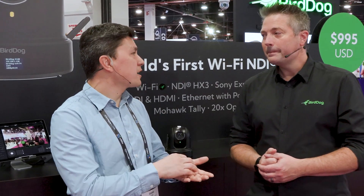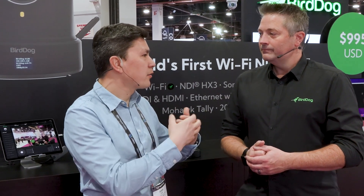A little bit of tech specs — let's talk sensor size, zoom range, and the lens ramping from wide to telephoto. So it's a 20x zoom, which is actually a really quite long zoom — it's amazing how far in that 20x throws. A lot of smaller cameras, particularly this size, will only be 10x in terms of their capabilities. In terms of the clarity of that, it's all glass, so it's a really high quality zoom. In terms of the sensor size, it's a 1/2.5 inch. It's a reasonable size sensor for the type of camera that this is, but if you actually look at the image quality, the behavior in low light is really incredible. That's owing to the types of sensors we use within our cameras — BirdDog is really quite unique. We build our own cameras from the ground up, we specify exactly what sensors we use, we build all of the electronics inside, and then of course all of the interfaces on top, so they're purpose-built for production.